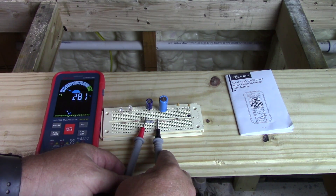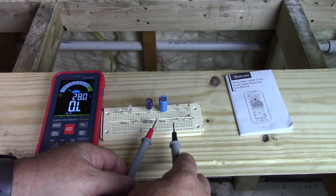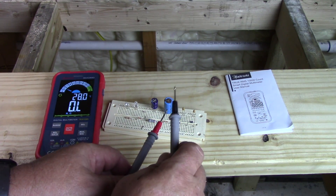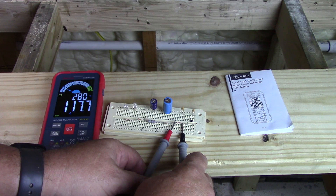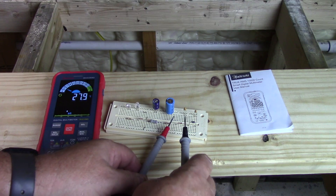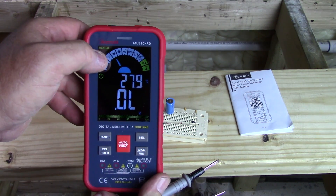Here is our 2.2k which reads 2.167k — that's really good. Our next one is a 3.6 ohm — making contact here — it reads 3.5, pretty good. The next one is a 360 ohm resistor, and you can see how close that reads. Our next one is a 120 ohm resistor and it's reading 118 ohms — pretty accurate. Remember these resistors are plus or minus 5%, so the meter is actually accurate, the variation is in the resistors themselves.